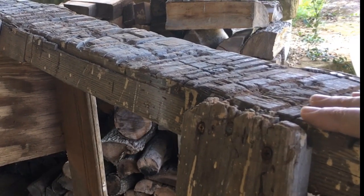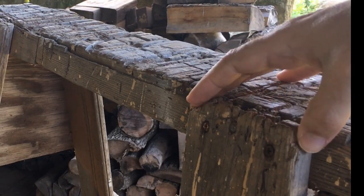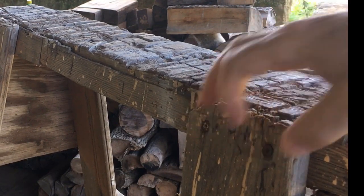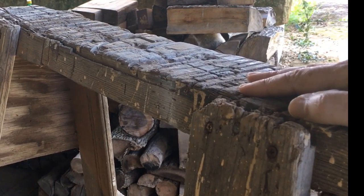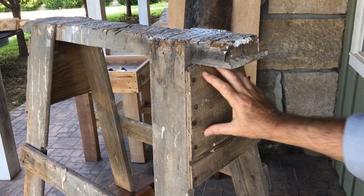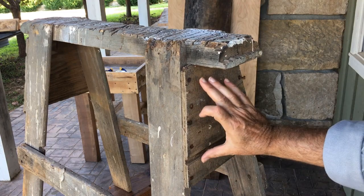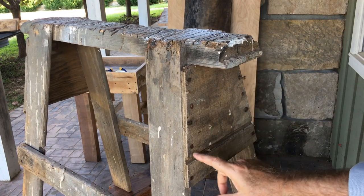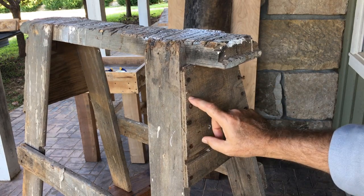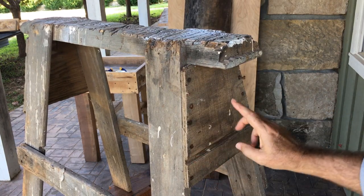Also, you will notice that the sawhorses do rock, and that's likely because I did not glue at that time. So 30 years of stress back and forth has worn the screw holes in the wood a little bit loose, I'm certain. You'll notice for the ends back at that time, I used just a scrap piece of plywood. Here I did use three screws on each end, and it looked like years later someone came in and drove some roofing nails in here in order to increase the strength, which made me think that 5 would be a better number to use on the ends than 3.